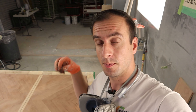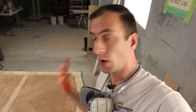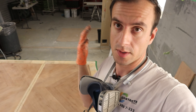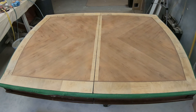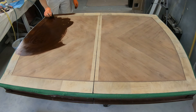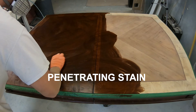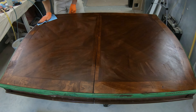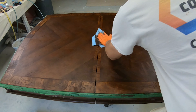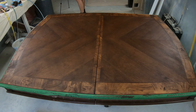It looks like I'm ready for the stain. Some people call it penetrating stain — it will penetrate into the grain, and then I wipe off the excess. It is a solvent-based product, so I'm using my gloves, my respirator, and all this good stuff. I spread the stain evenly, and I try to be consistent and work section by section so we don't have any darker and lighter spots. It's also important during this stage to keep my sample — my final result — close to the wood I'm working with, just so I know what I'm trying to achieve in the end.